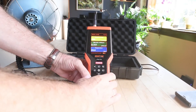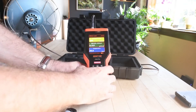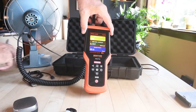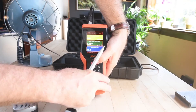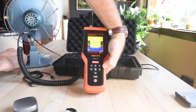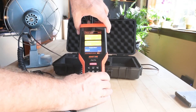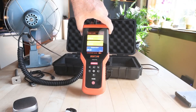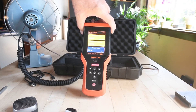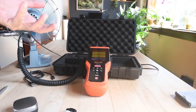Because of the true peak capability of the software that runs on this device, it's curious to note — for example, I may want to be looking for a knocking in the bearings. Let's push the measure button and tap this while it's taking a reading and see what happens. Now we're getting an alert on our bearings, and that is a direct result of my tapping on the fan. A knocking bearing or some kind of problem within the bearings may be indicated easily with this device, giving the operator an immediate status.